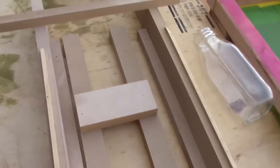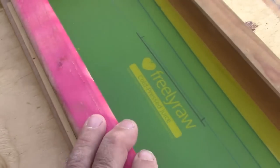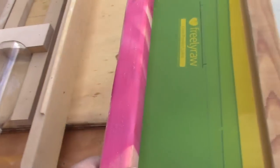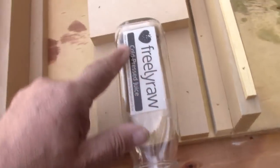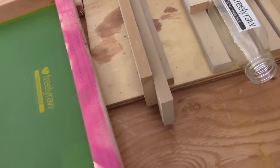I finished the printer stand for the bottles. A bottle's gonna fit in there like that. The screen — I cut it down. I put a little ridge there to hold the screen steady, and a stop so the screen goes in the same place each time. We taped the artwork on the bottle so we know where we needed to put it — that's how we lined it up. I just stapled MDF in different areas to hold the bottle and hold the screen. That's our printer — now we have two printers. We're gonna start printing now.